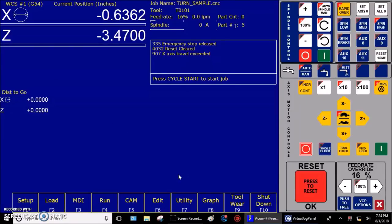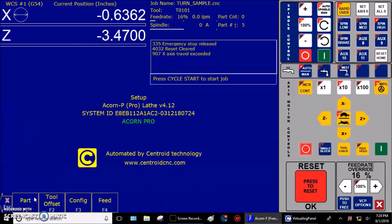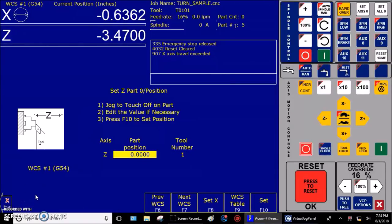Proceeding on to step four. Making sure our DRO has the WCS display set. We're going to press F1 Setup, F1 Part. In step 4b, it says enter zero or the known part position in the part position field and then press Enter. I just skimmed the face of my part, so that is going to be zero for me. I'll enter zero and press Enter. If you were touching off a piece of shim — say a five-thou thick shim — you would enter that value. My master tool is one.